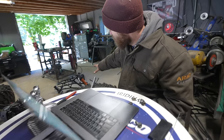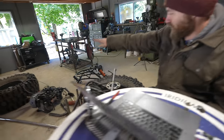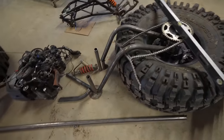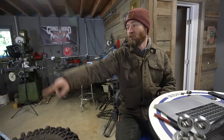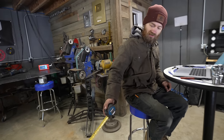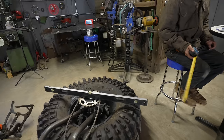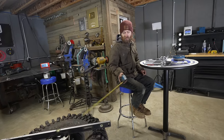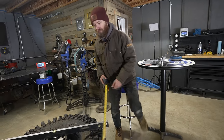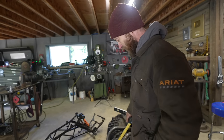I've switched to a horizontal design and visualization stage of the process, meaning I laid the tires on the floor and I'm just laying out parts. If you stand up on a stool and look down on that, it kind of looks like a motorcycle. Now that I have that done, I can start building the swing arm. But before I build it, I need to figure out the pivot points at the other end. And it gets very complicated because I have to have a jack shaft.